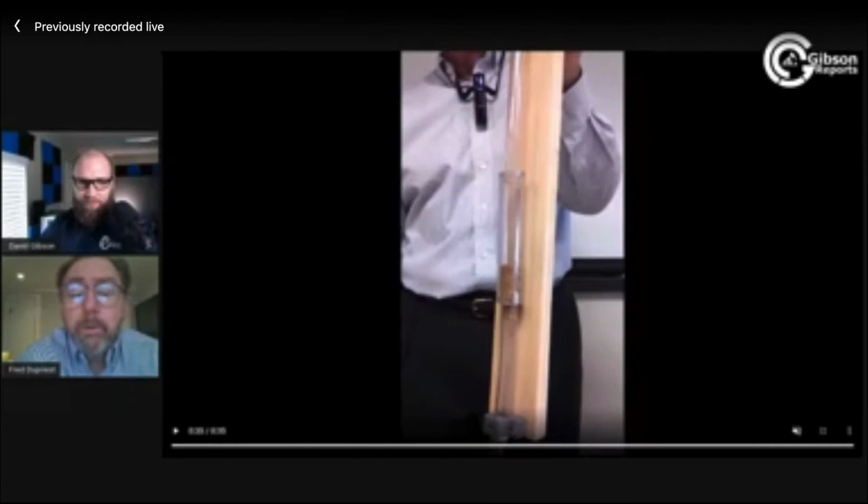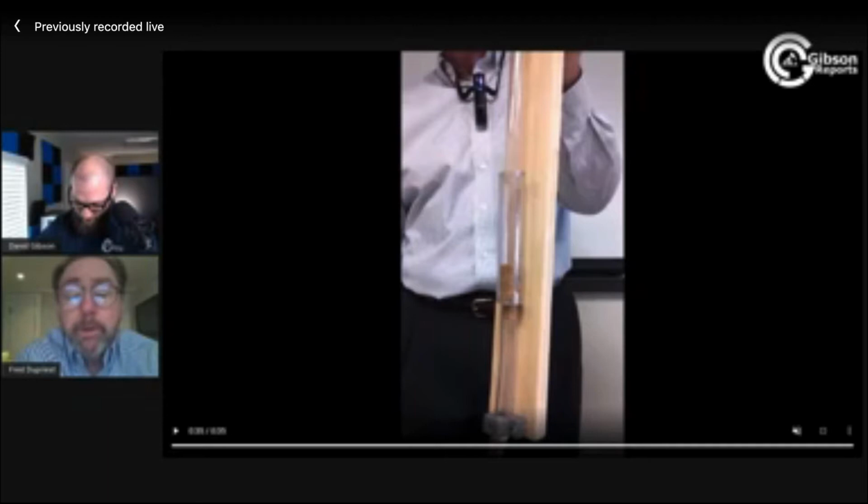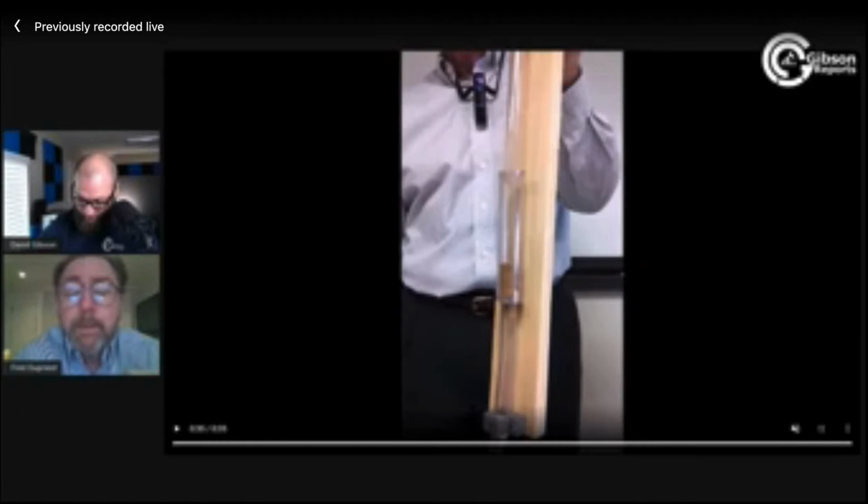I get some out of that, but what you would see in real life on your rig, you just see pressure spikes or some general broad increase, a few hundred PSI in pressure, maybe 100 PSI, as you circulate the well, due to this extra force required to push these things out of the hole. In that hole size, my basic slip rate exceeds my flow rate until it gets crowded, and then I'm really punching through the middle, so now slip rate is less than flow rate.